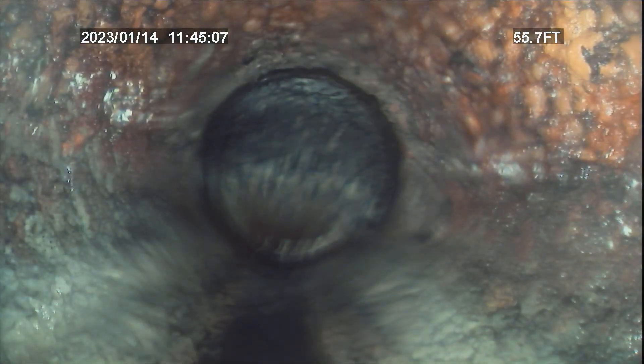I'm not going to push back any further. This line's cast iron is pretty compromised. There is about a 29-foot section of line that is just holding water, from this toilet flange out to where the Y is for the rest of the units. I'm going to start pulling back. You'll be able to see right here — it's draining good.